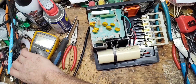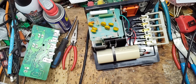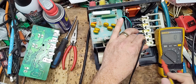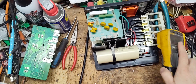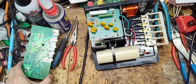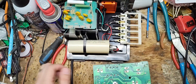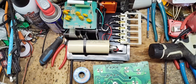Let's check the capacitor — we can fix the board, no problem there. I don't think Gallagher can do board repairs on their old stuff anymore. It's basically basic soldering and electronics skills to get by. This is a 40 microfarad capacitor — it's reading 34 out of 40, so we'll go ahead and change that while we're at it. Let's fix what we know is bad first before we keep digging into it for no apparent reason.